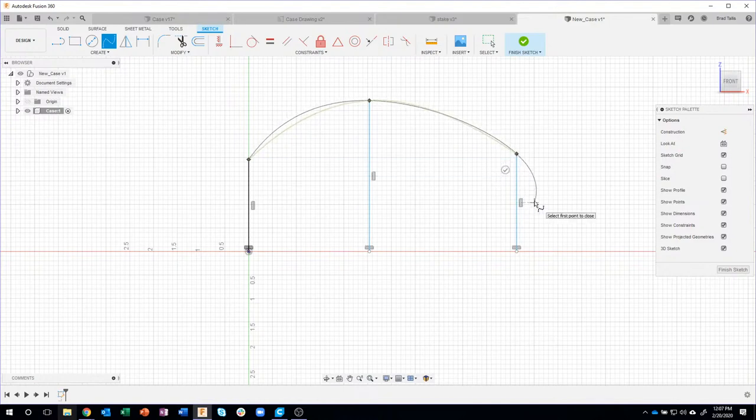Now, when you're creating a fit point spline, you need to make sure that when you're done, you hit this little green checkbox. Okay? And notice these green handles. These are your tangency and weight handles. So you'll notice that it's trying to follow the spline, and so it's a little bit more horizontal right here as it goes through that point, and then it angles down through that point there.